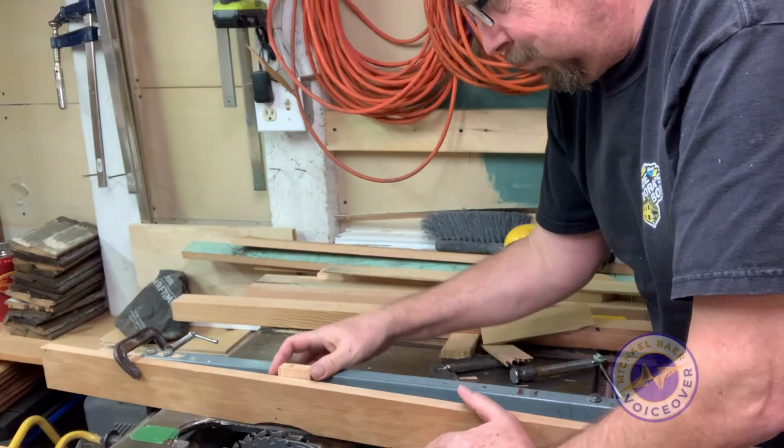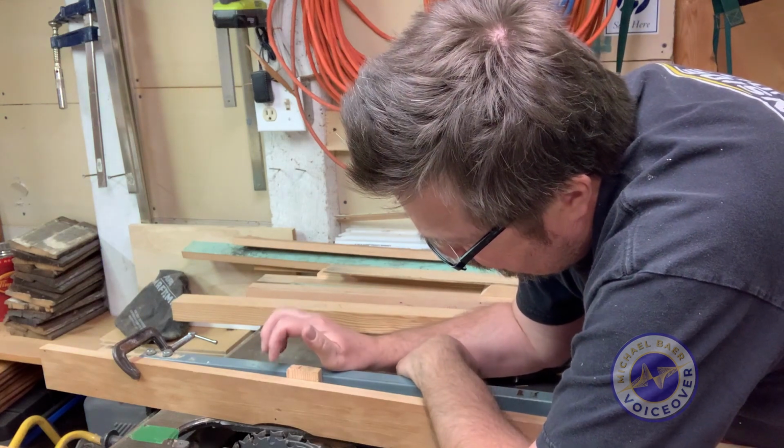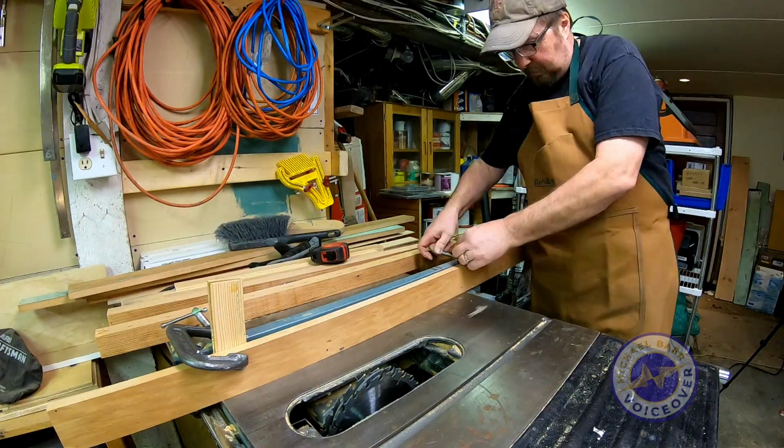The challenge I now have is I have to figure out how to set up a jig for my fence on my table saw. I'll put a dado blade in my saw, and I need to rip the rabbeted channel that's going to take the pane of glass in each of these sashes. What I have to do is figure out the angle that will traverse 38 inches, which is the height of the window. It'll be a fairly slight angle, but it'll be an angled glass nevertheless, which will help to remove some of that sympathetic resonance, which is what causes sound to come through windows. It's not going to eliminate it entirely, but at certain frequencies it certainly will. It deadens the airspace.